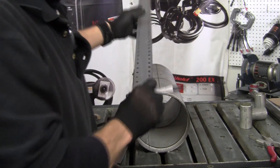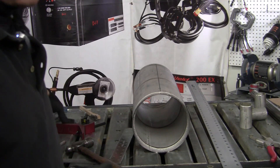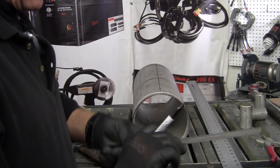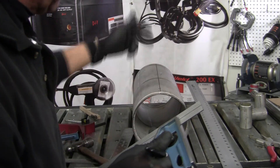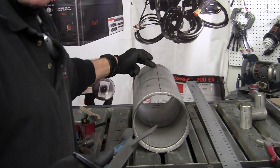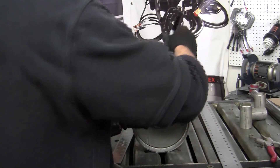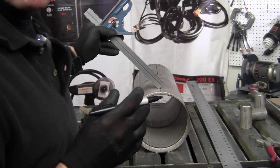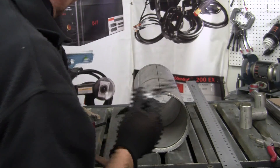You can use a scribe or soapstone — there's your two points. Now use your combination square to find where you want to set your two ports. I said two inches, so you set that at two inches. You know these are your center points on both ends, so you have to measure from one end and from the other end to make sure they're in the same spot. Go two inches — and that two inches doesn't necessarily have to go exactly to the center point.